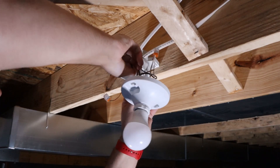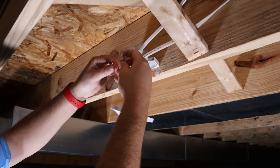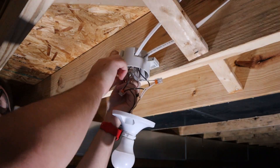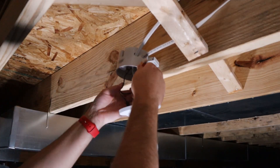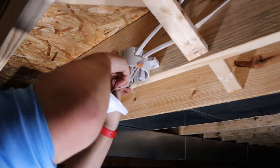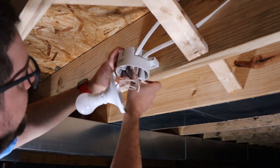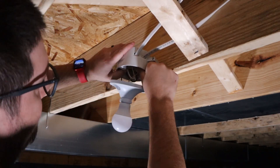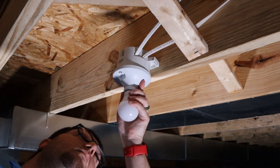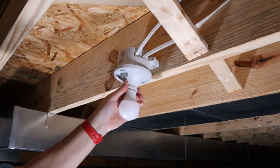With all the wires stripped, I went ahead and put them right into the wire connectors. It's always important to remember that the black wire is the hot wire, and that means it's the wire that's going to have the voltage going through it — in this case, 120 volts. The white wire is going to be your neutral, which means it's supposed to be zero volts. If something goes wrong, that's what the ground wire is for, which is the bare wire that doesn't have any sheathing around it. Once all the wires are in their connectors, I just tuck everything up, get the screws into the fixture itself, the little junction box, and just get the light fastened on there, and it should be good.